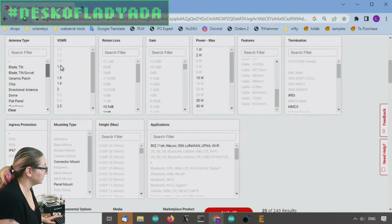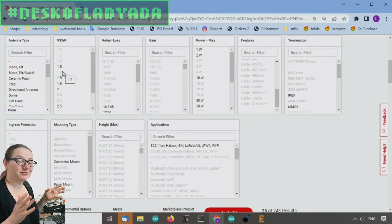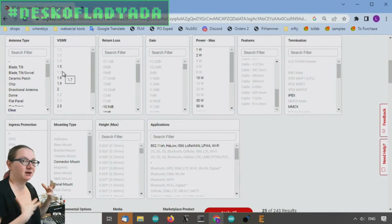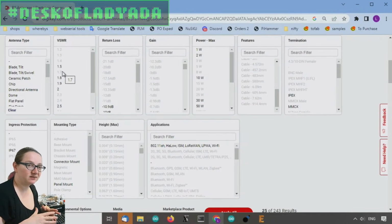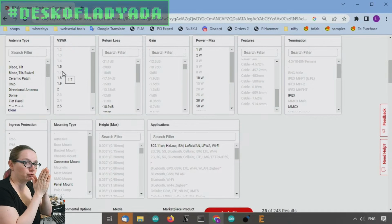There are other antennas. The basic trade-offs you're going to get with antennas, without going into 5 years of antenna education, which I don't have, is there's directionality and the matchingness of the gain. Directionality is actually called the gain of the antenna. I want to warn people, if you're an analog engineer, you'll think the gain of a circuit is how much it amplifies. These antennas are not active antennas. Unless you're purchasing an active antenna, the gain doesn't give you more. It just means how much more directional it is.